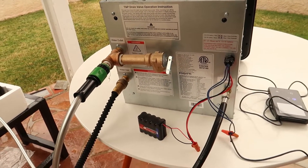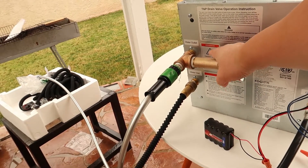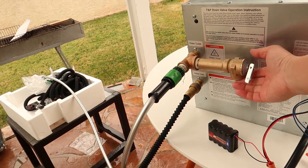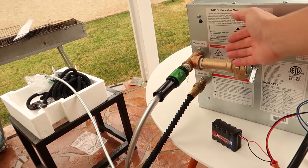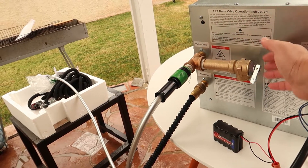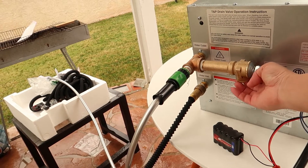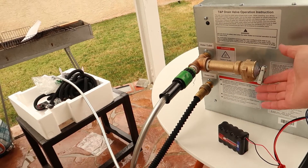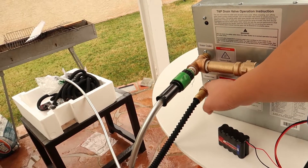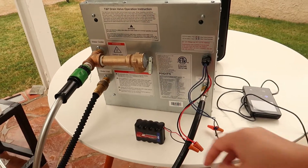As you can see, I have everything set up. First thing first is the hot water. I have the T-shaped connector with the pressure and temperature relief valve — if pressure or temperature gets too high, water will come out. Connect this with a pipe to outside your RV. And this is the inlet — cold water — so I just connect to the hose.